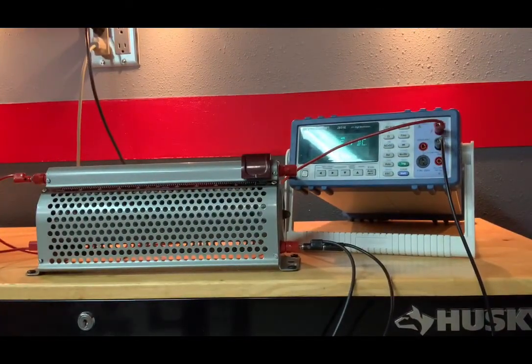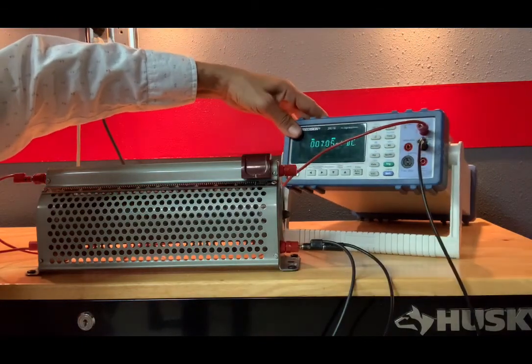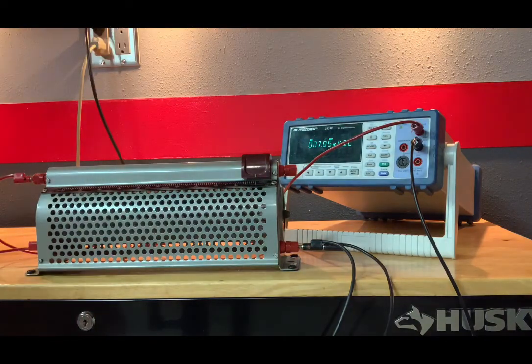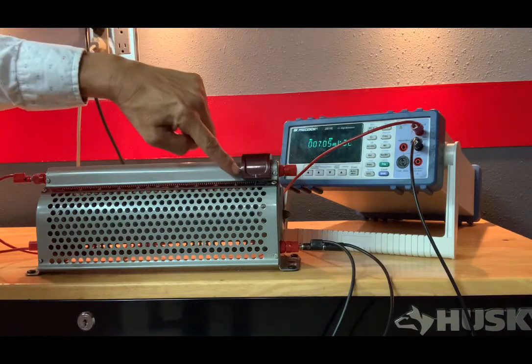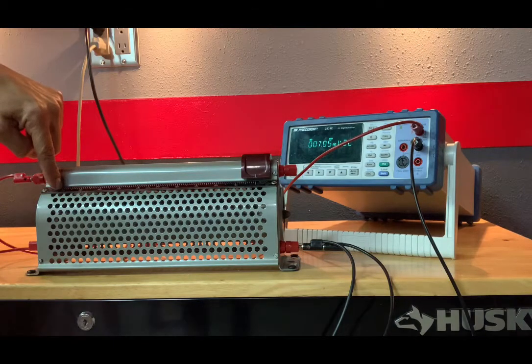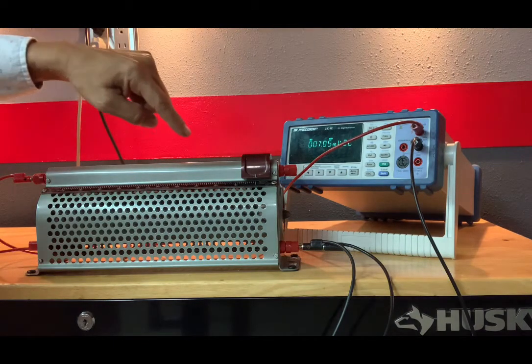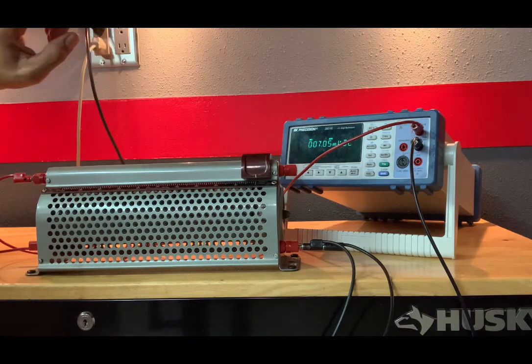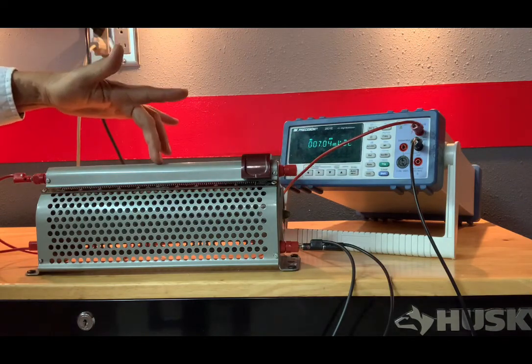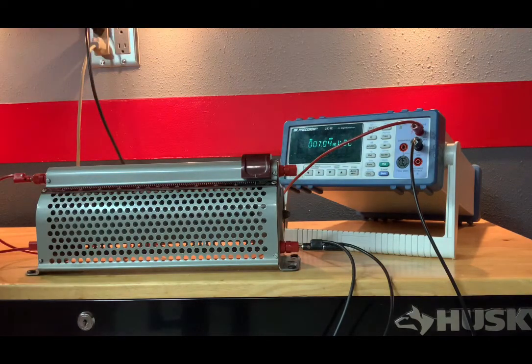I'm going to move you closer. I see that there's a glare on this multimeter, but I'll read it out for you anyway. What I want to say first off is the rheostat position. The units of that position are going to be percentages. In other words, there's a scale on top of this rheostat, and it goes from 0 to 10. And there are tick marks. The minor tick marks are spaced out at 1% intervals. So when I'm halfway, I'm at 50%, and so on.